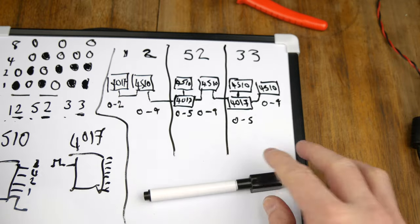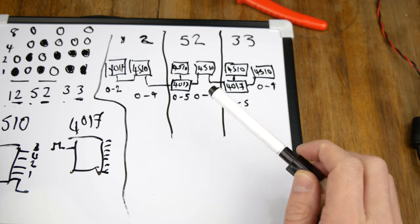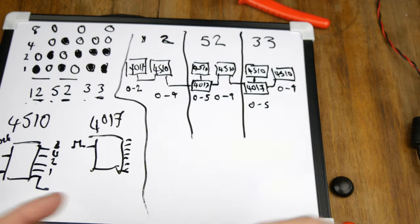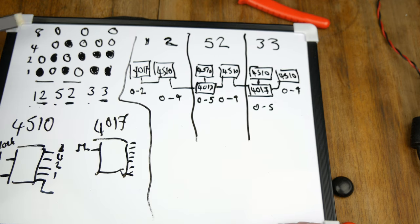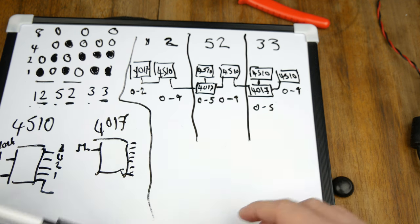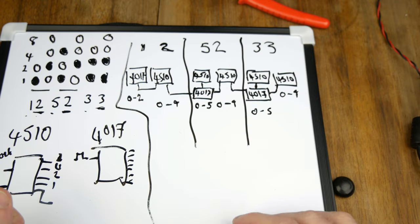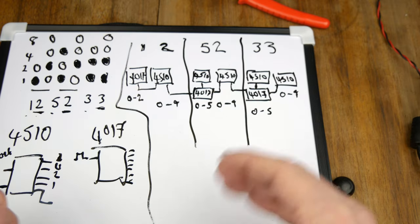I don't know, you'll have to let me know if that is even remotely attractive to anyone. So it'll be connected to a bunch of LEDs. Those will be LEDs that you can put anything in. So what I'll do is probably put transistors on each one of those LEDs. So if you wanted to power something that took more than 10, 15 milliamps, let's say, then you can do.